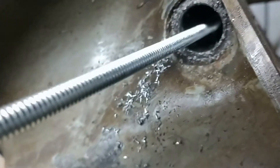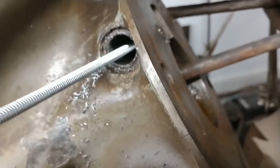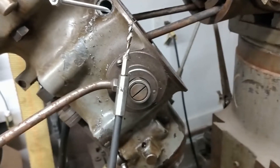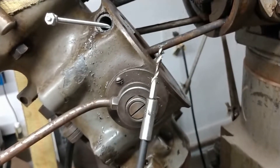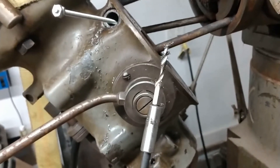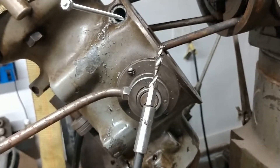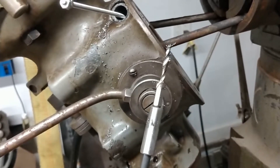It's reasonably soft metal — unfortunately you can't see in there, but I did drill it, tapped it, tried this abomination that drills and taps at the same time. Other than making your ass pucker a whole bunch as you slowly thread it in there, it seemed to work pretty good surprisingly. Keep the RPMs extremely slow, and in my case I drilled it first and then ran the drill/tap thing in through there, because you need a hell of an extension to get down in there with the actual tap.